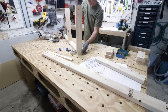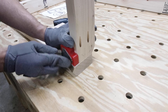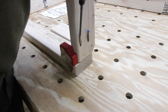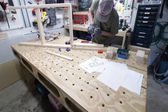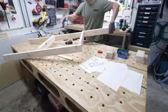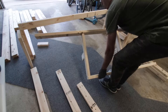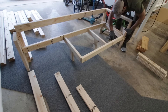Back up on my workbench, I'm assembling the short side frame support. I'm using these awesome spacers to help me drop that seat support three-quarters of an inch below the back and front frame supports. This allows the seat slats to be totally flush when I get done with the project. Here I'm attaching that non-angled cut part that's a seat support — I ended up realizing I had to take that off so that I had room to attach the frame, then I'll put it back on in a minute. After I got the frame finished, I took it over and put it on the ground to install it to the rest of the frame that's starting to come together. You can see that I had removed that seat support slot on the back there.